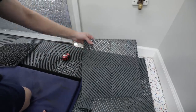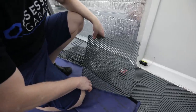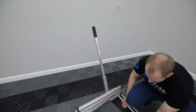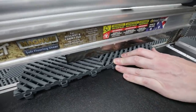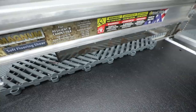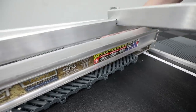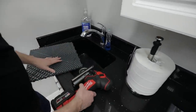Here's how I'll cut this one. We'll use the floor tile cutter — you could also just use a straight edge and run across. I'm going to floor-tile-cut here and then jigsaw cut that, because my chop saw is not here. If you do have a floor tile cutter, you really need one that has a shorter blade so you have the opportunity to make cuts like this. That will give me my lengthwise cut, and then I'm going to take my jigsaw and make the other cut. For this garage, this is one of the more sophisticated cuts.